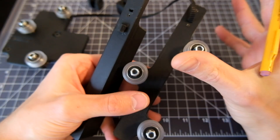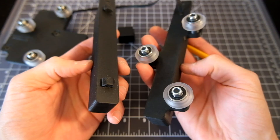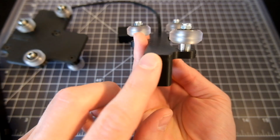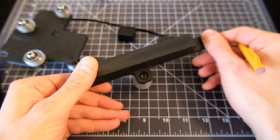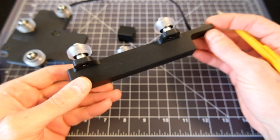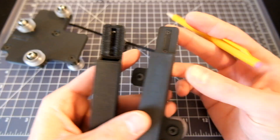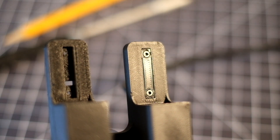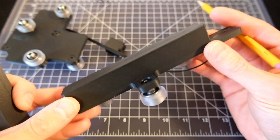Earlier in the video I mentioned that there are a bunch of secondary enhancements that come from using the 20 by 40 millimeter rail. The first one is the removal of these tabs. With these tabs gone I now have a flat surface to work with for this part, and when 3D printing that's really important. I can put this flat surface face down on the print bed, which means I don't need any supports for this part. In the area around the belt clip I needed support material to make this part printable, and that led to a surface that was marred, inconsistent, and pretty ugly. In the new part, where I don't need support material, you can see how smooth and clean it is. So that's a huge improvement — there are no surfaces on this new part where support materials were needed at all, so it's just a cleaner, better looking part.